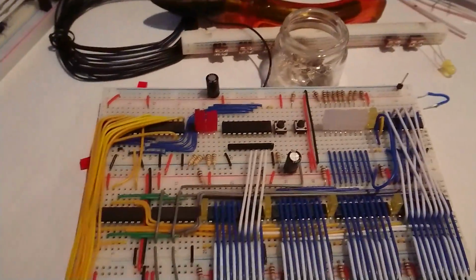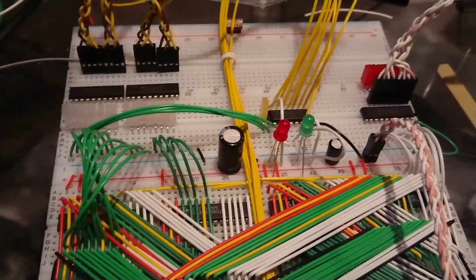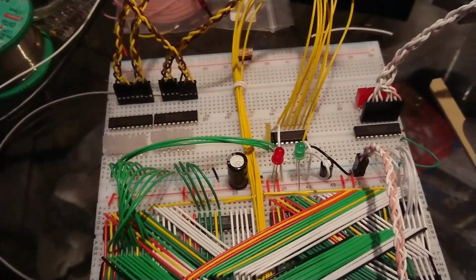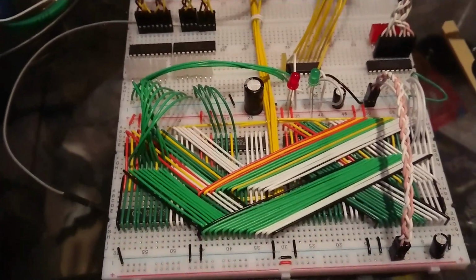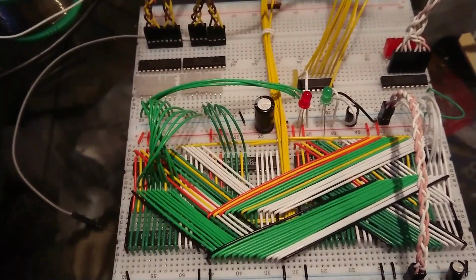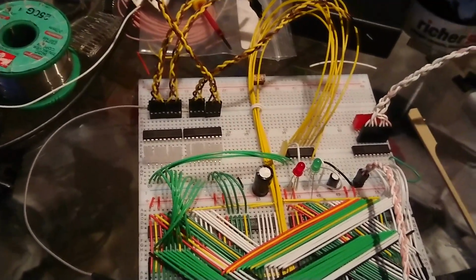I think that's going to be the most straightforward thing, if both of these memory units exposed the same kind of interface. So I want one active low signal to tell the memory module to output onto the data bus, and I want an active high, a rising edge active high. No, I suppose that's a bit redundant. So just a rising edge signal to tell them to write into themselves. So yeah, I mean, I don't know. Actually, yeah, I think I've got the data sheet here. Let's just have a look.